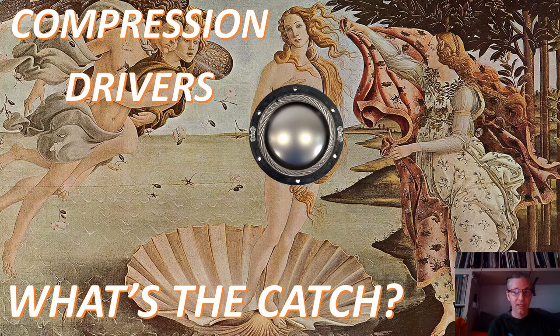To be fair, the modern tweeter had a higher frequency extension, so it went up beautifully up to 30 kHz, but at the cost of just distorting the crap out of itself when pushed hard. So it means that even though it can go out far, that's really good when you listen to it at a quiet volume, but if you are pushing it hard, then getting distortion at 20k plus is just going to wreak havoc on the sound you are getting out of it.